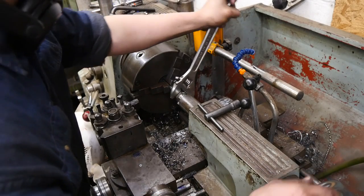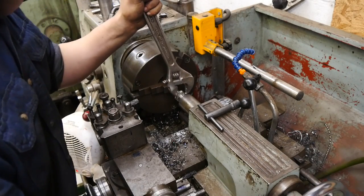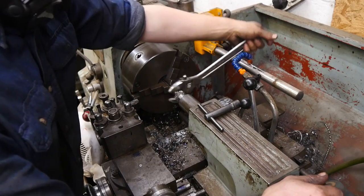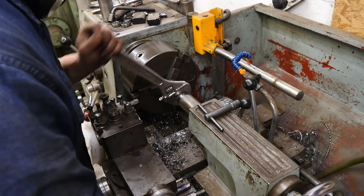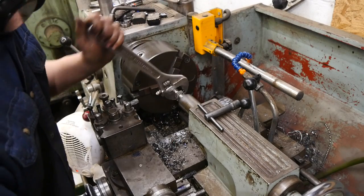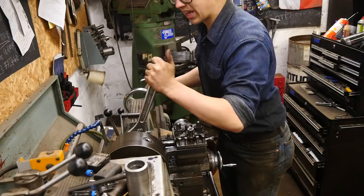I'm using a die. I've got my lathe in a low gear, so there's so much stuff you've got to move for the chuck to turn, so it holds it pretty well. I've got a Morse taper adapter in my tailstock which is working very well for keeping the die nice and square on to the workpiece. Then as I turn it I'm just kind of feeding in the tailstock handle right there.